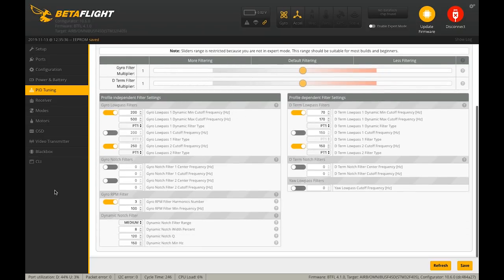Here are all our stock filters — gyro RPM filter is enabled. RPM filtering has come a long way in Betaflight, and the quads are going to fly pretty good. If your quad does not fly well on stock PIDs — maybe some prop wash or shakes — that's fine. But if your quad is making weird noise or having weird issues, your PIDs are not going to fix those issues. Your quadcopter should fly perfectly fine as long as it is well built.